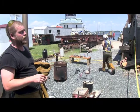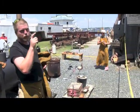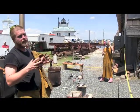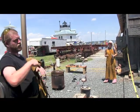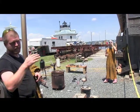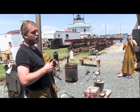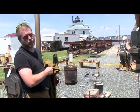And same thing goes with bronze, right? When we cut them up, there's little tiny sprues and stuff like that. I just keep feeding them in, you know? I start with two big ingots that fit in there, these ones from the trays. They fit in there, and then I just fill stuff in around it. And then it's basically a practice of keeping it full as it goes. But you don't ever want to pack anything into the crucible, because if it's under stress and then it heats up and expands, it could crack the crucible.